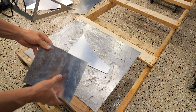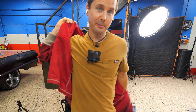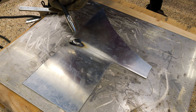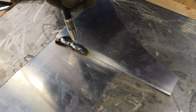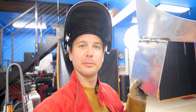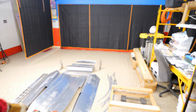I found some 1/8-inch aluminum scrap, so we'll try a simple butt weld. You're about to witness the first time ever pulling the trigger on a spool gun to weld aluminum. Whoa — I just burnt a hole straight through it. My angle's wrong. That looks like crap, but it's pretty strong — you can step on this thing and bend it and it's not going anywhere. I'm just going to practice a little more and then we'll see if we can zap this whole boat together.